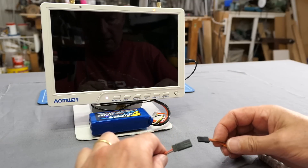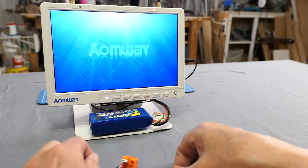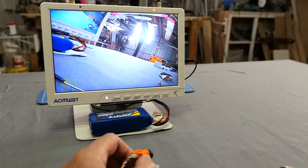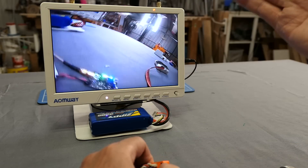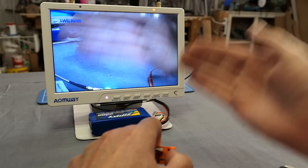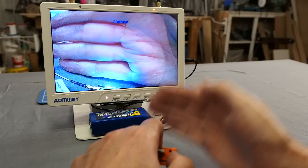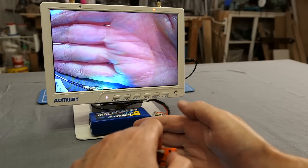I'll plug it in and we'll go through these hand gestures. I've got a 5V battery here just to power everything — it is limited to 5V input voltage for the little transmitter. So if you put your hand in front and pull it away, it starts flashing. We can cycle through: sunny, cloudy, indoor, light tracks, twilight, personal, back to sunny. Hold for 3 seconds and we move over to power — 200mW, pit setting, 25mW, 200mW.